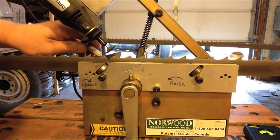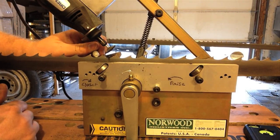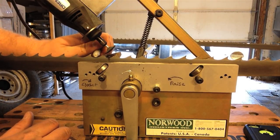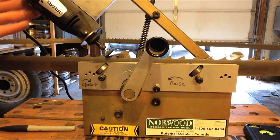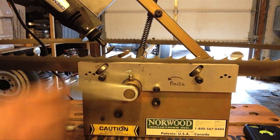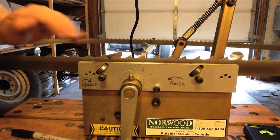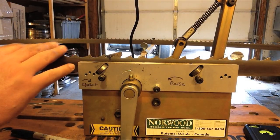You don't want to just do the back of the tooth, because when the blade flexes and heats up, you get micro cracks right here in the gully of the blade and it starts to split. So when you grind off this gully, you're actually getting rid of those cracks and re-stabilizing the blade. You'll kind of get a feel for how it's supposed to feel after you sharpen it, and you'll be able to tell if you did a bad job versus a good job — there's a very slight difference.